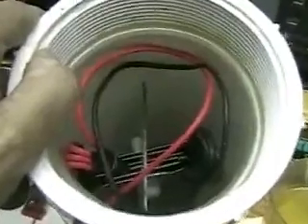Now we'll take a look at the inside. You can see the plates — there are six of them, and they're 12 inches long. Electrodes on alternate plates: positive, then negative. You can see a good shot of the spacers there. That is a divider in the center, which is keeping the plates in the center of the unit — that's all it's for. When we fill the unit, we fill it just over that.